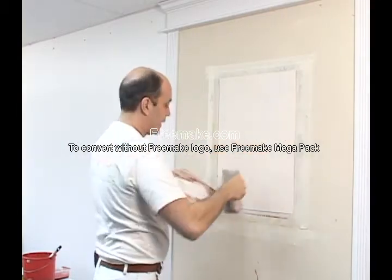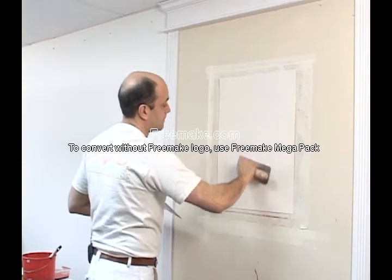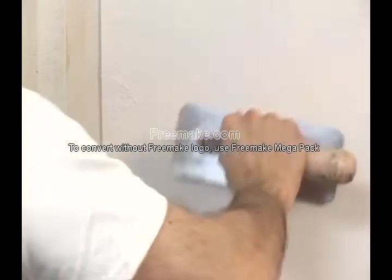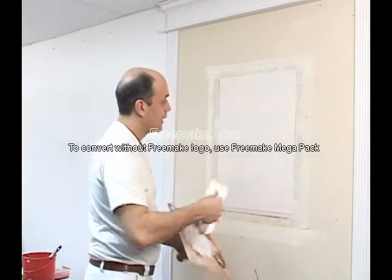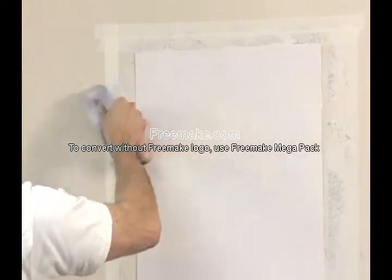And again, I'm going to use a skip trowel application, but a very tight one, which means we're going to leave few holes between a full coat. This is applied in a thicker layer than a Venetian plaster, and first I cover a surface of a few square feet, and then I go back and refine the area and decide to close in some of the area that is still too open.